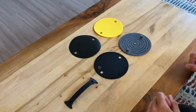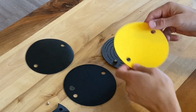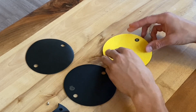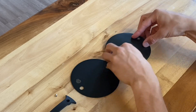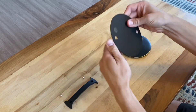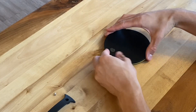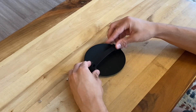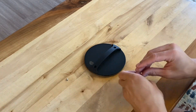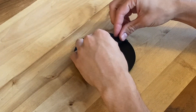The steel is engraved, the felt and rubber are cut, and the baron pads are ready — so let's put it all together. I have all the components laid out. First I take the felt pads and match the color to that of the baron pad. It aligns easily around the bosses, as does the rubber compliant pad which I apply next. The stainless steel plate is aligned in the same manner, with the chameleon logo on top as the visible side. Finally the handle rests right on top, also aligned by the bosses, and the two screws are dropped into the pockets on the handle ready to be installed with a screwdriver.